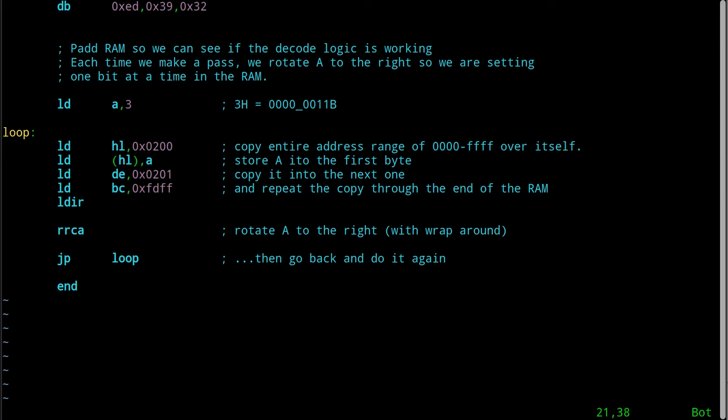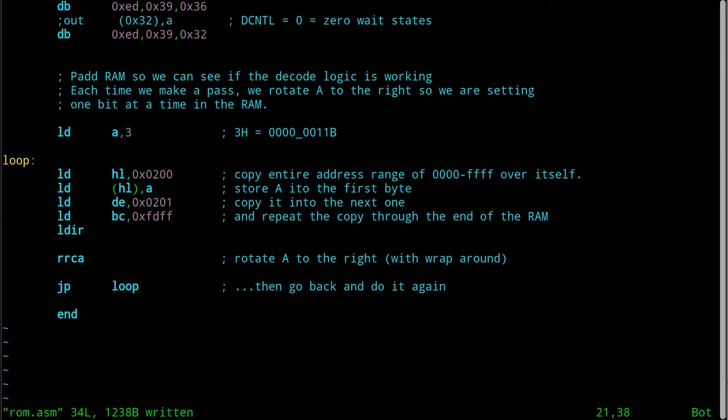Now, I wonder if you use the 0x notation like I did down here. It's good to be using as many different notations as possible, all in the same example. Keep the reader on their toes, yes? Anyway, the point is, you got all zeros followed by 2 ones. You can put anything in here, and this program would still work. The reason I chose this is because when I output a value to the LEDs on the FPGA board, and you saw that was the code that's different, we'll come back to that in a minute. If we output this value to the LEDs, I'll have on, off, off. And these 2 off in a row surrounded by these on LEDs will be very visible, okay? And that's the whole goal of this thing.